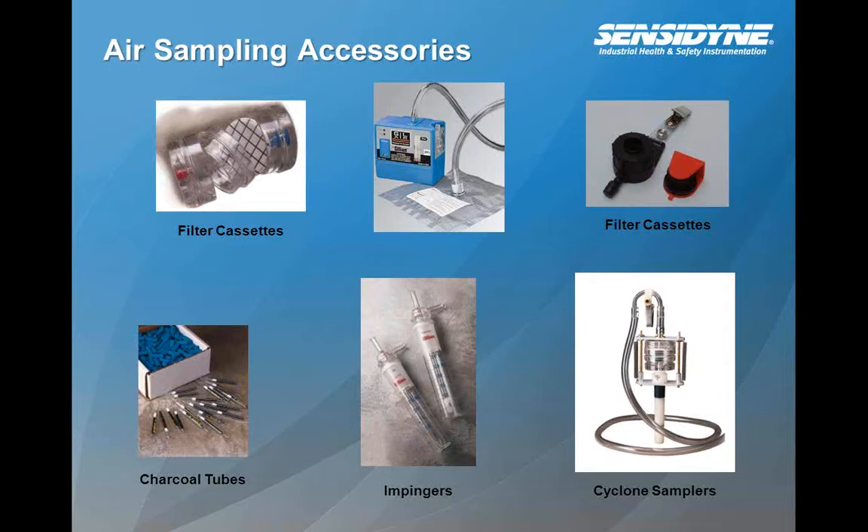Here are a few of the different types of air sampling accessories. You have a filter cassette — here we have a three-piece filter cassette. If you want to collect a grab sample, you fill up a Tedlar bag; this looks like about a one-liter Tedlar bag, but these bags come as large as 100 liters. For some environmental applications, you're collecting 50 to 100 liters. Here's another type of filter cassette for particle sizing — getting down to collecting dust at certain particle sizes, maybe 10 microns, 1 micron, and 5 microns.